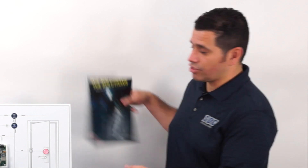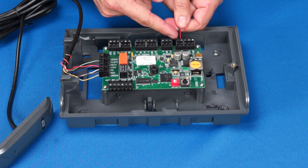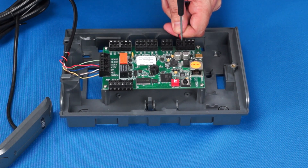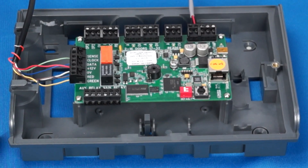So, back to our demonstration. Our 12-volt DC terminates here. Positive DC voltage lands on the terminal labeled 12V, and DC ground terminates on 0V. Now that all the connections have been made, I will power up the board.